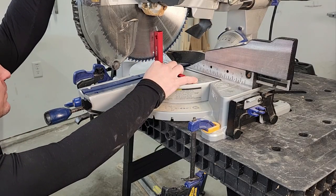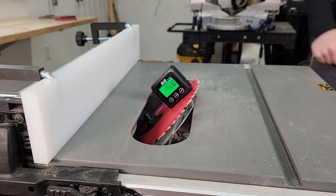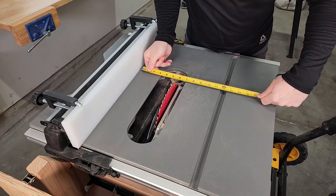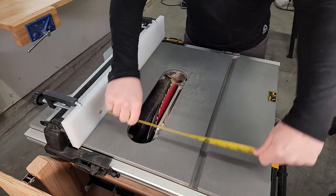Make sure your blade is cutting perpendicular to the workpiece. If you're cutting a miter or bevel cut, measure the blade angle so your parts fit together as you intended. If you're using a table saw, also make sure that the blade and your miter slots are parallel to your fence. If they're not, you could experience kickback, binding, pinching, or burning.